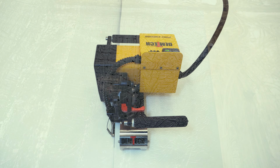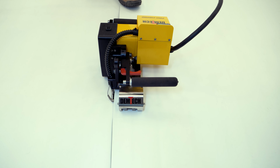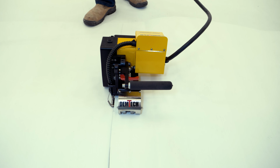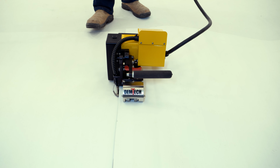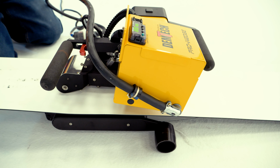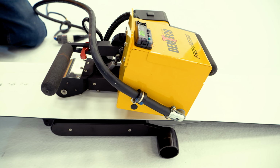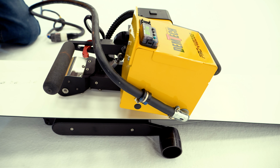Once panels are placed, they are ready to be welded together using the Iso-wedge. Please refer to the geomembrane field seaming section of the GSE geomembrane installation quality assurance manual. Before welding a seam in the field, all welders and welding machines should perform and pass a trial weld.